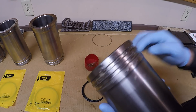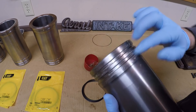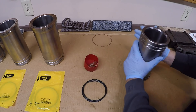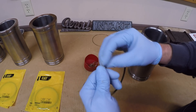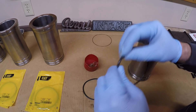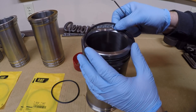Take that goop and really lubricate everything around both of those sealing grooves and the flats above them — that's just going to aid in getting those seals rolled on. You want everything well lubricated because those seals are going to go through quite a traumatic event when you push them down into those block bores. Coat both of the seals as well; basically everything in contact with this rubber gets a generous amount of lubrication, because you certainly do not want to cut or damage these O-rings upon installation.